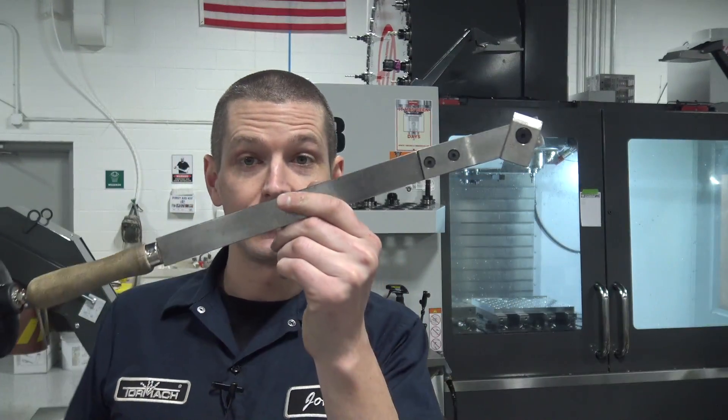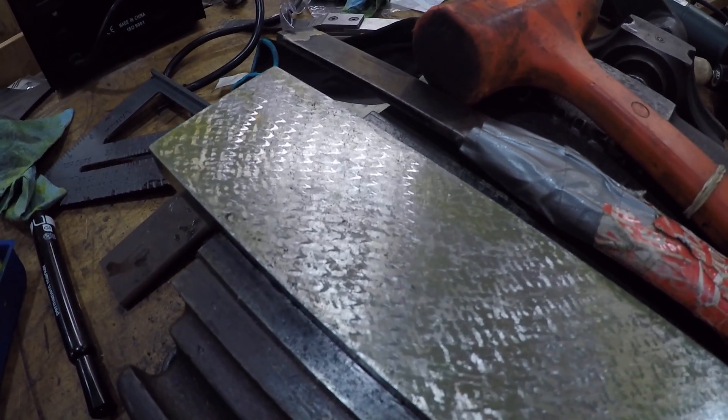Again, why is scraping great? You can't always put a whole part of a machine onto a surface grinder even if surface grinding were the right technique — it can be huge, and you may not be able to afford or get to a surface grinder that big. With a simple hand tool or the powered version, you can scrape any machine. There's also something called flaking. Flaking is something you do after scraping to create deeper pockets for oil to sit in and create a little channel for it to slowly work its way through, keeping the oil there. Flaking might be a thousandth to two thousandths deep.